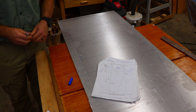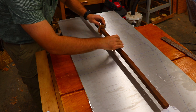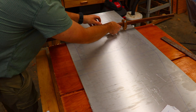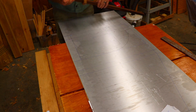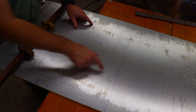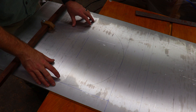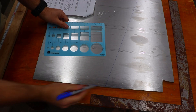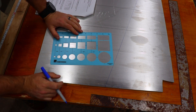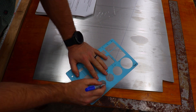The last thing I need to do is swing this arc. I'll use my beam compass that I made back at the start of this series and trace it up. With the arc drawn it's a little bit undersized, but I'm going to leave it that way because this will be rough cut to shape and then blended in and sanded smooth so I don't have any stress risers. The radius of these two bottom corners is 13 millimeters, which equates to a one-inch diameter hole, so I can set this stencil tangent to the two edges and trace in the arc.